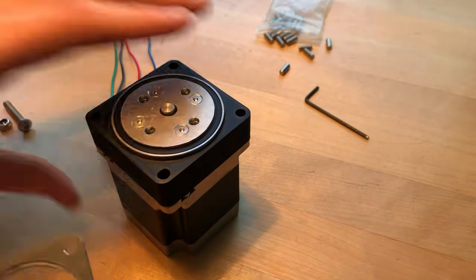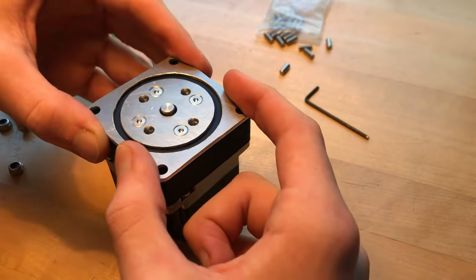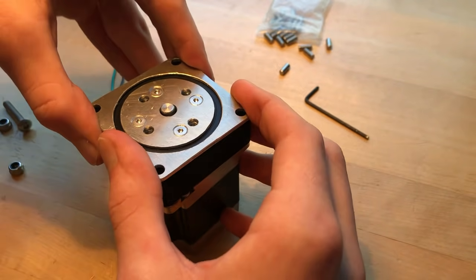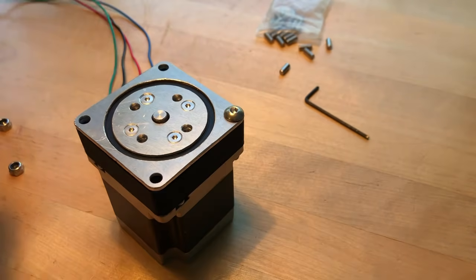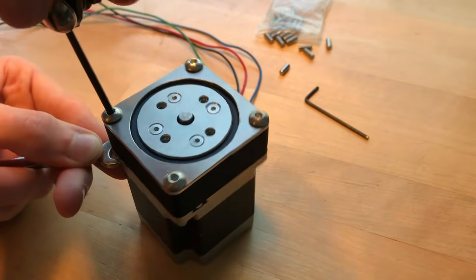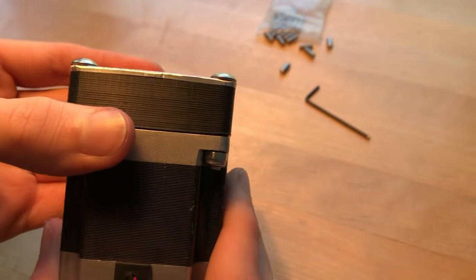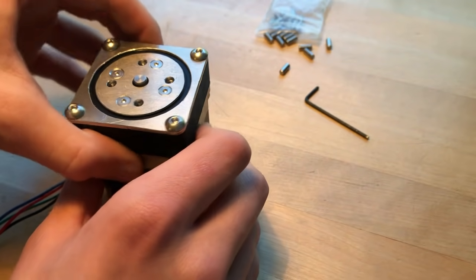So now I can take my end cap here, that's this guy, and I can stick it right there. You'll notice that this has a lip on the inside of it. That'll go over the edge of the bearing here, so it'll clamp everything down. So now everything will be rigidly held in place. All right, parts of this end cap is bowing a little bit. You'll probably see it, which is somewhat concerning, but let's see if it actually works.